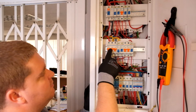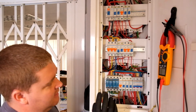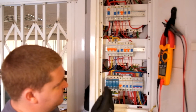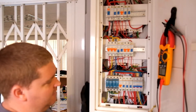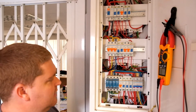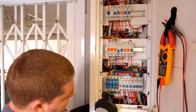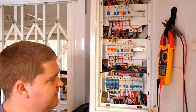There is also an output 40-amp breaker over here which is feeding downstairs to a three-phase power point, tapped off from here. This isn't my work — I think it's atrociously untidy. I'll be resolving a few issues here over the next couple of days and doing a video on that. You've also got feeds coming off the three input phases to what is basically a surge arrestor to earth — connected to earth at the bottom — connecting the three phases and the neutral line to ground for safety, for lightning strikes, to protect the electrical equipment in the building.